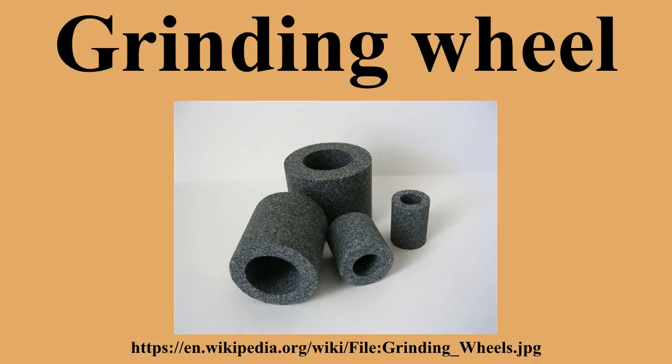The thinness allows grinding in slots and crevices. It is used primarily in cutter grinding and jig grinding. Saucer wheel, a special grinding profile that is used to grind milling cutters and twist drills. It is most common in non-machining areas, as saw filers use saucer wheels in the maintenance of saw blades.